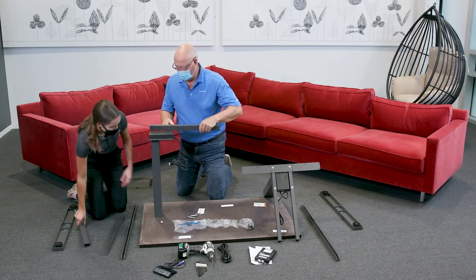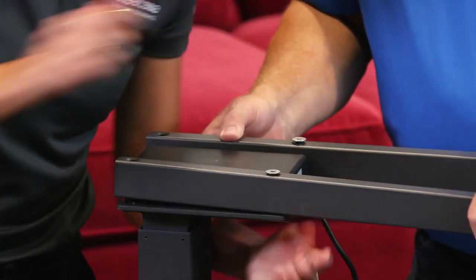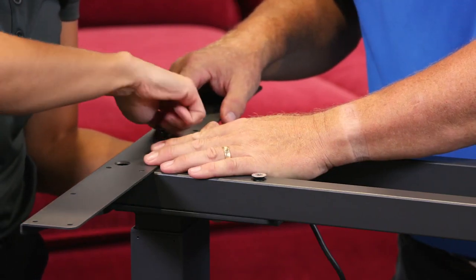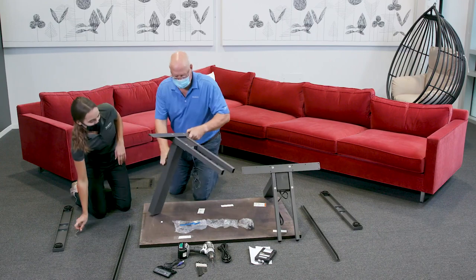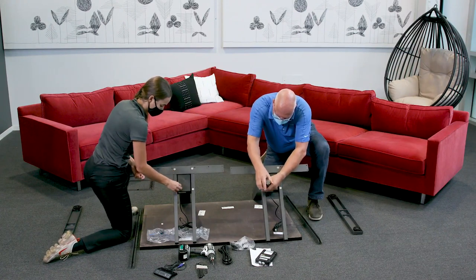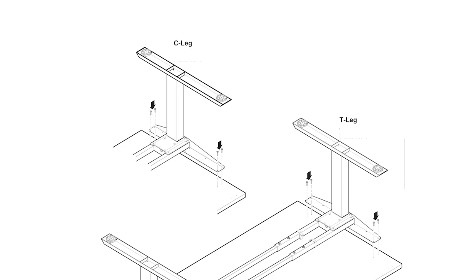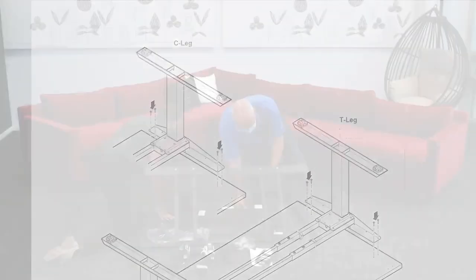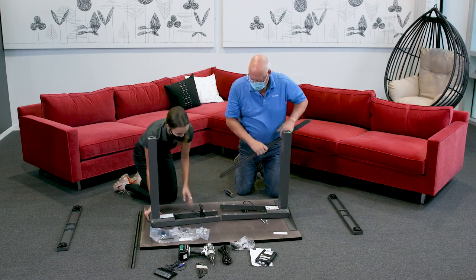Step two: repeat this process for the other leg. Note: if your desk width is less than 52 inches wide, you may need to undo some of these M8 bolts. The front edge of the work surface can be identified by pilot holes near the edge for the user switch. For T-legs, the leg assemblies aren't handed. For C-leg applications, place the larger portion of the cantilever towards the front edge of the desk. Once both leg assemblies are built, place assemblies on the work surface with the cross tubes facing inward towards the center of the desk.